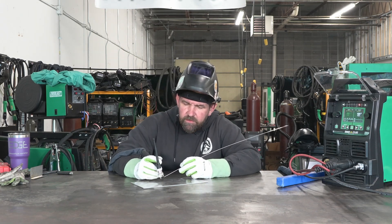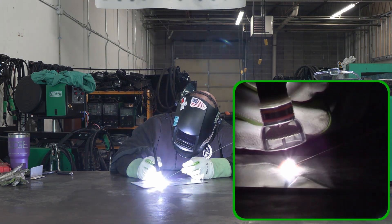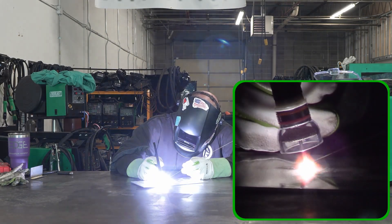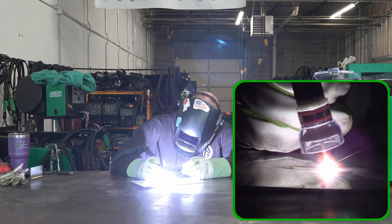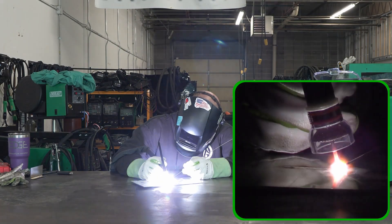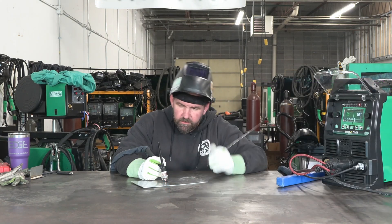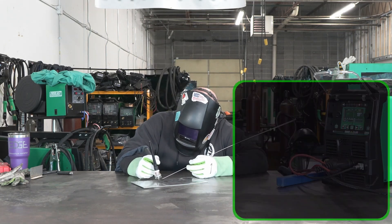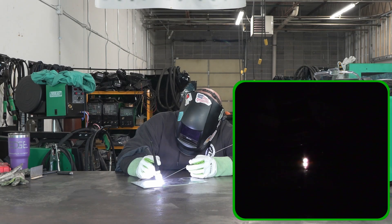Let's just make a real short run. Real nice, real nice pop on the start. Just using a little pedal pulse here, adding a little bit of filler — we get a real nice stable arc even running up and down, just like we should. The Edge cup gives absolute maximum gas flow coverage, no issue there ever. Let's do another real quick start — we're going to light up.